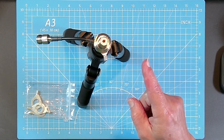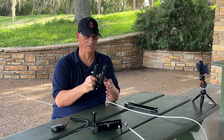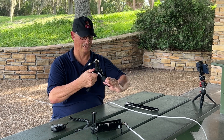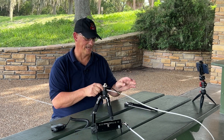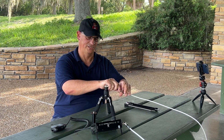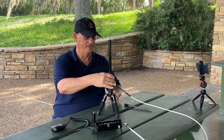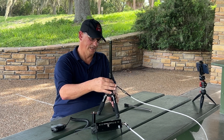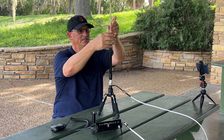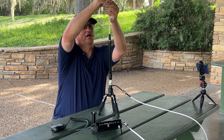Let me show you how many antenna systems I have that this works with. The first thing I want to show on this Gable antenna tripod is just how simple it is to use. It unfolds with self-clicking mechanisms that lock in place. You'll want to go ahead and attach it to your coax — it does have a pigtail right on the end of the tripod. We're going to start with the Gable antenna itself, and just this quickly, we have the antenna set up to either do two meters in its current configuration or extend it to get on HF.